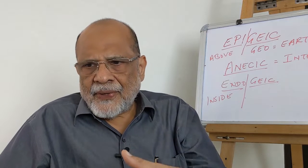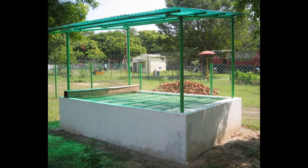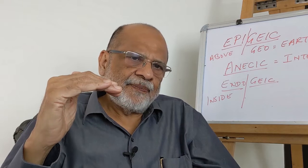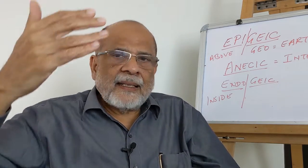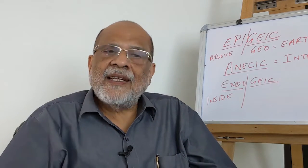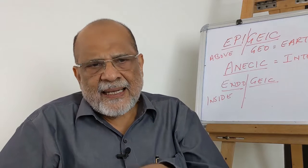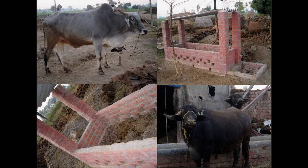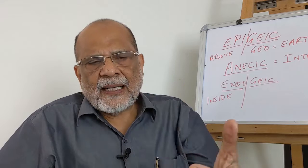The designs shown include one with a shade and a small tank, or small chambers that can be constructed. If you want a room constructed, remember the walls should be only about three and a half to four feet high — the remaining should be mesh for air movement, otherwise there will be a lot of heat when you enter. If working with buffalo dung in North India with farmers, make sure the unit has more holes because buffalo dung has more moisture.